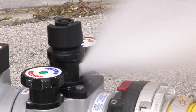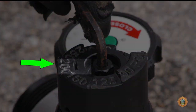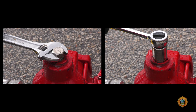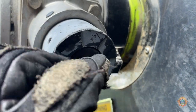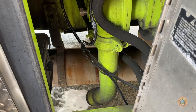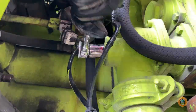When dealing with high discharge pressures, relief valve settings may need to be adjusted if they are not set to the standard pressure of 200 PSI. The portable hydrant relief valve can be adjusted with an adjustable wrench or 7/8-inch socket. The Akron ball intake valve can be adjusted with an adjustable wrench or a 7/8-inch socket. The TFT ball intake valve can be adjusted with a 1/4-inch Allen wrench. The apparatus pump relief valve can be adjusted with an adjustable wrench or a 7/8-inch socket.